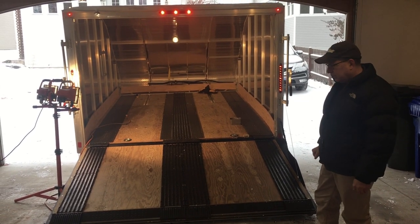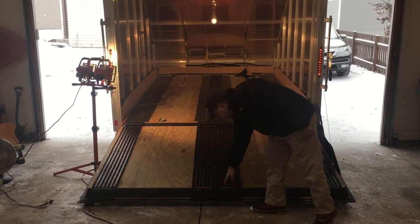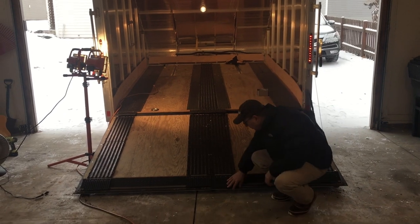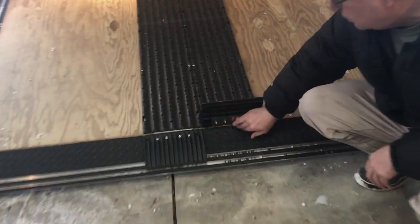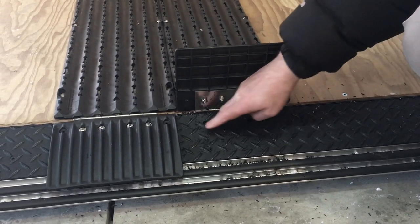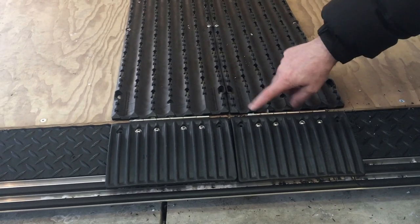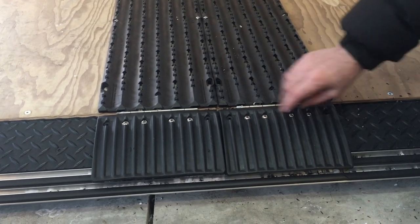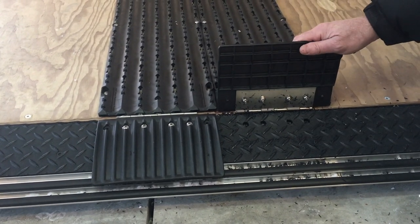A couple of tricks that might be helpful: when we installed the Edge Glides, we decided to put the hinges right up against the edge. In doing so, you've got nuts and bolts on the bottom that are going to extend out. So in order to have this fit flush, we went ahead and drilled holes into the rubber material. We accomplished that by installing the hinge first, then drilling pilot holes down through the hinge holes, and then larger holes once we had the pilot holes so that everything lined up correctly.